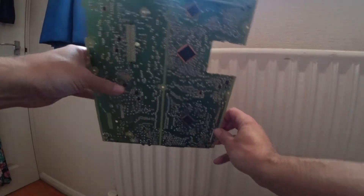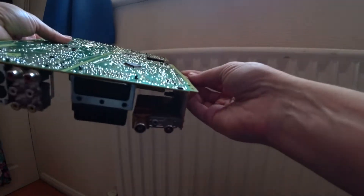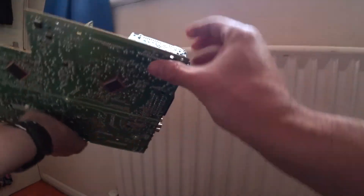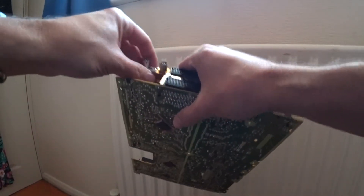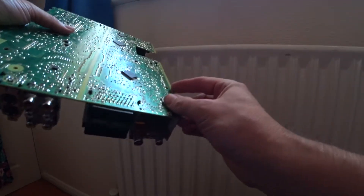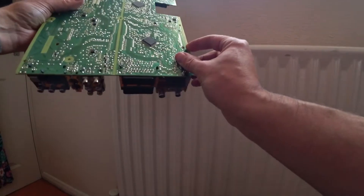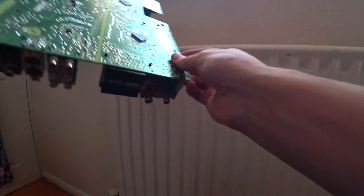Turning it around — so that's here. There's a hairline crack there, and where this modulator sits it's basically put some strain on the board, and it's unnoticeable from this side. But when you take it all out you can actually see there's a little crack there, and that's the reason why this doesn't work.